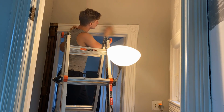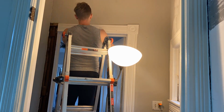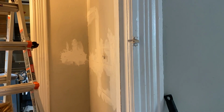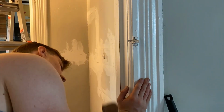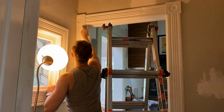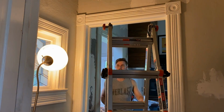First, we sand. I think I started with the super worn 180 grit sandpaper and then switched over to a new 220 grit. I didn't want to rough up the paint too much and cause it to fully peel and create more work for myself like I did in the kitchen, but I did want to remove any paint that was already peeling and rough up the surface enough to help my primer and new paint color adhere and last.